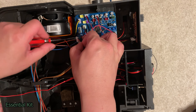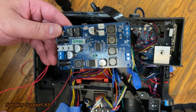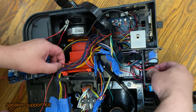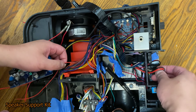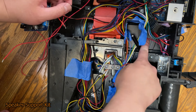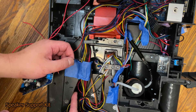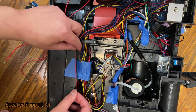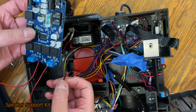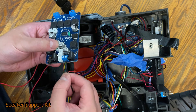From package A, take the 4-wire double-ended 6-pin housing. Take the bigger end and plug it into the wave trigger. Take the other end and plug it into the gray connector where it says 'wave trigger' on the audio board. Next, take your GP Star amp board and connect the power first. Route the power cable down and up through here, as we'll be installing the amp board right here. Connect it with red positive on the left and negative on the right, then screw them in.